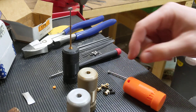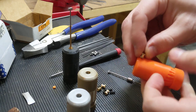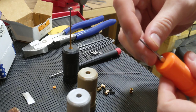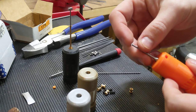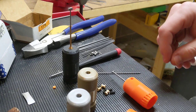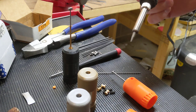Basically, the major thing you have to do to build these is take your brass insert that comes with the kit and sink it into the handle. You can do it one of two ways: you can just do it by eye, which is what I do, or you can insert the tip so that you don't go too far. I'll do it with the tip in place so you can see the process. I have my soldering iron heating up over here.